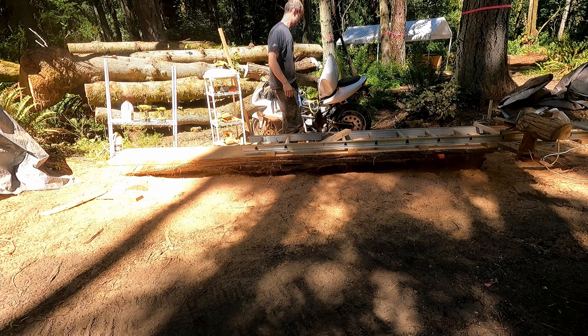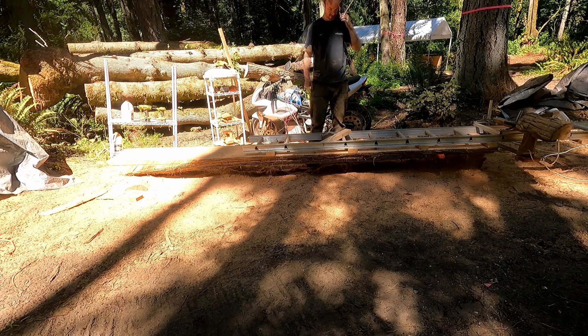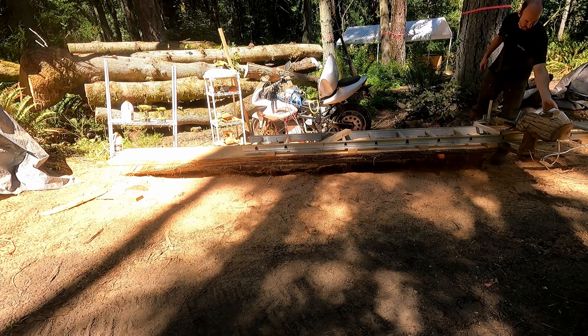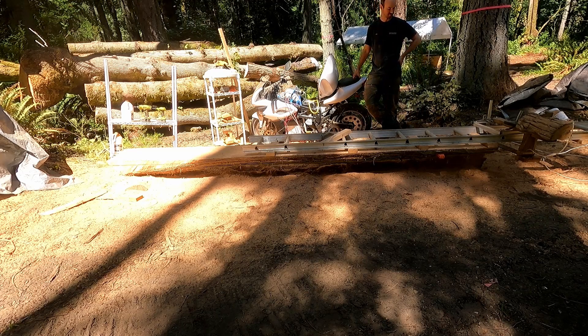See? Works great. That used 10% of the battery capacity — depending on how much sapwood is in there, how sharp the chain is, and some other factors that can vary quite a bit. I had a cut yesterday right through the center of this log, hardest heartwood, and I didn't sharpen the chain properly and used like 45% in one slab. But that was unusual. So plenty of battery to get me through the day. I charge it overnight, ready to go again in the morning.